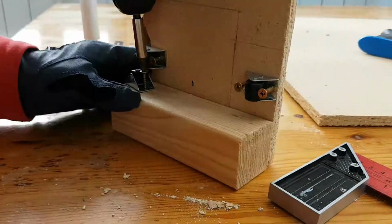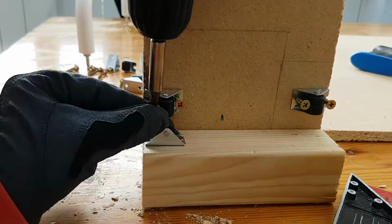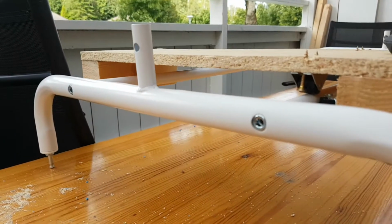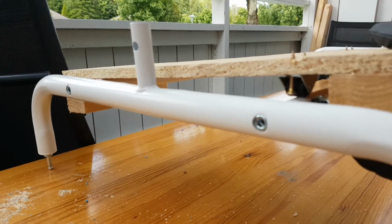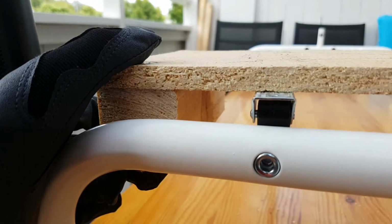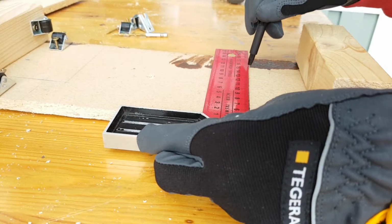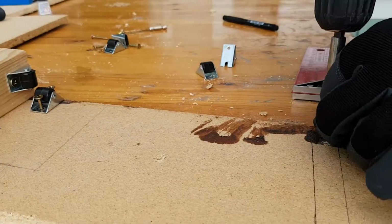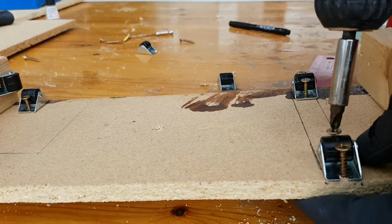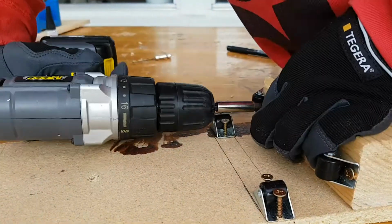Next, I secured the wheels onto the side too. They should be fixed, so they barely touch the previous wheels. Use the small screws here too. I took the platform and placed it on the rail, with all the 4 wheels touching the pipe. I stuck another wheel between the other pipe and the platform and marked the wood. I extended the lines using an angle ruler. On the other side, the vertical wheels should sit at each end in between the 2 lines, and the horizontal ones should be fixed to lumber as previously.